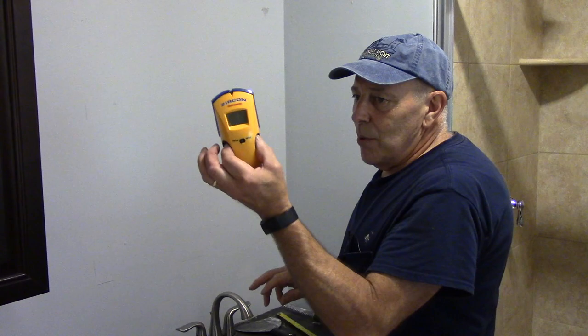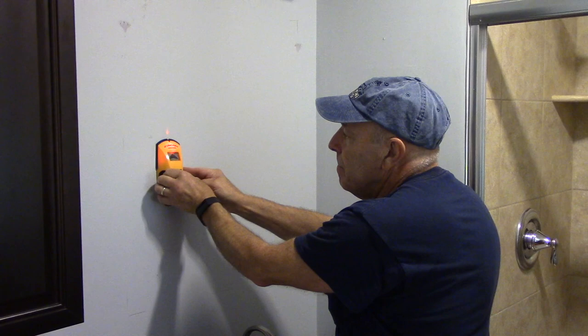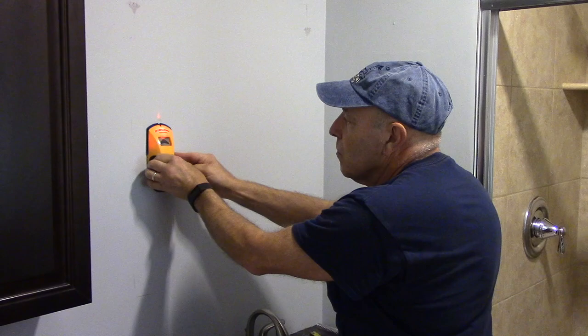In this case we are hitting two beams here and here. So what we're going to do first now is we're going to cut a hole in the middle of the wall right here just to verify that the studs are there because my stud finder tells me that they are. So we know there's a stud here. We also mark where the stud is over here.